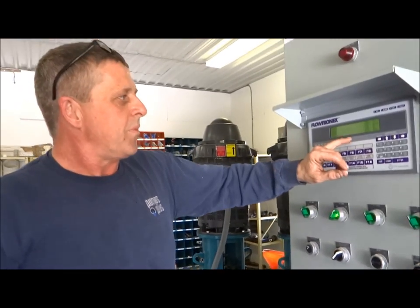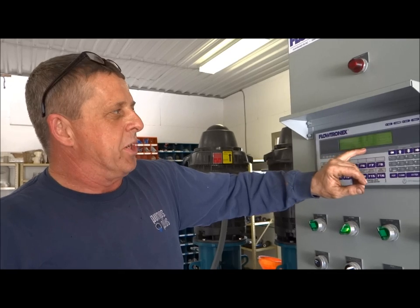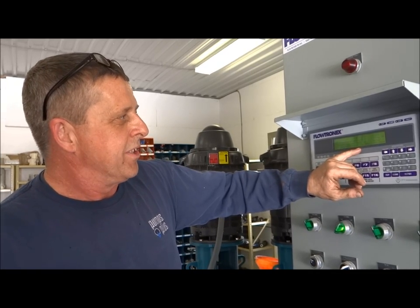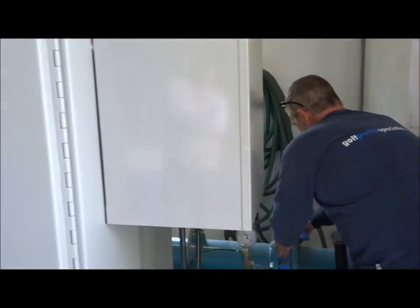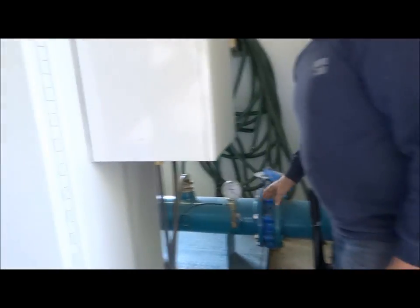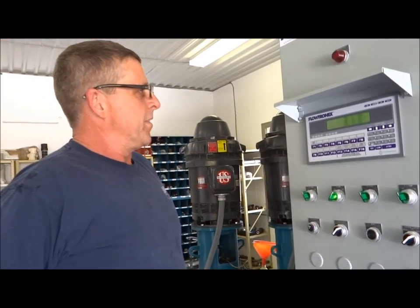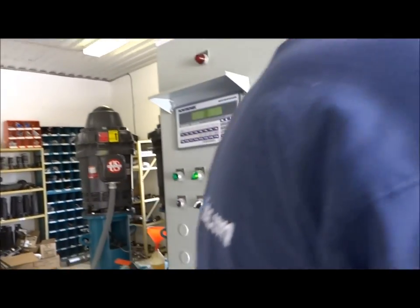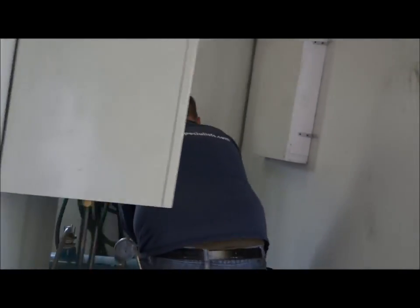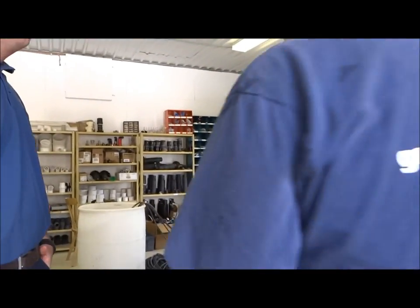Once you get up the pressure, it will control at 185 or 145 psi, and then see what you have for pressure. You've got about 90 gallons a minute now - you can crack it a little more. It doesn't take much. We're up to 250. You basically want it around 150 to 170 gallons a minute.